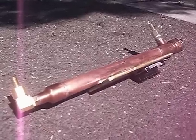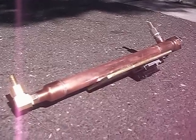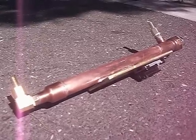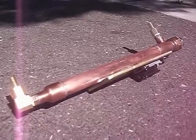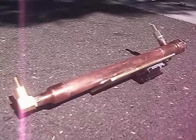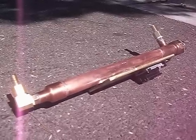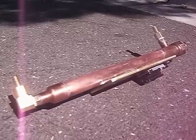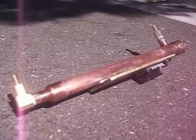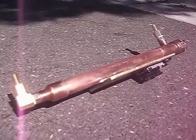The maximum you can put in is a 2000 watt heating element, so this is for bigger engines like Detroits, 6090s, 8090s, or any of the six or eight cylinder V71s. This can heat up the veggie oil to about 100 to 160 degrees Fahrenheit and send it through the engine, preheating it so the engine can be started on veggie oil.